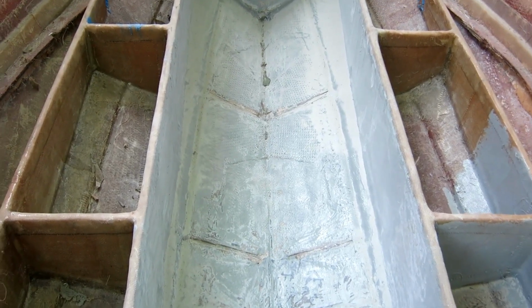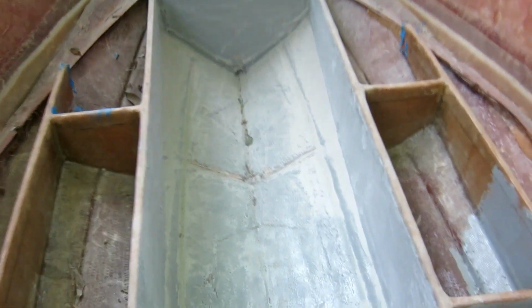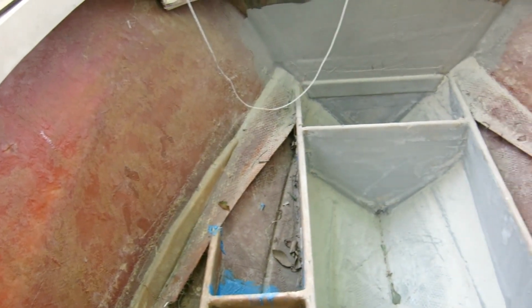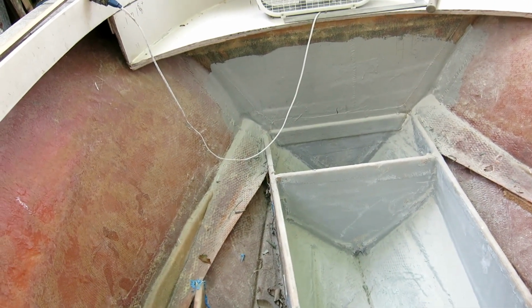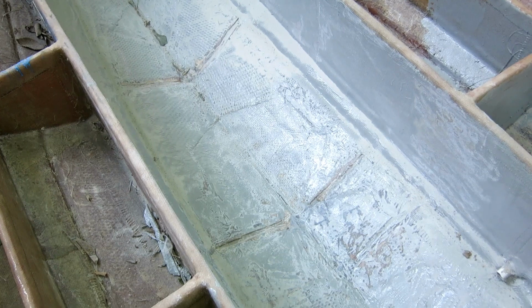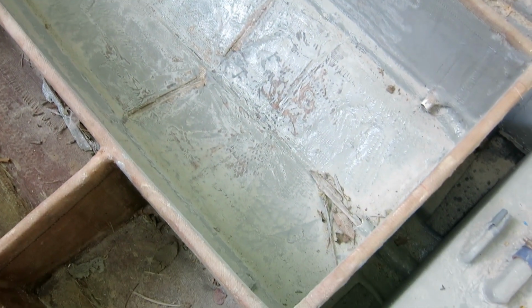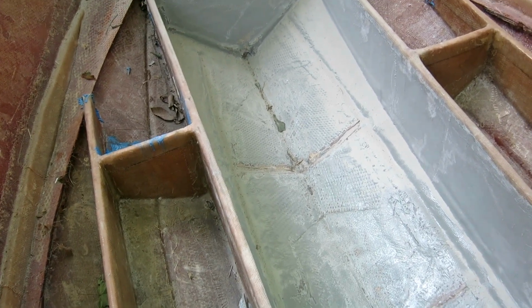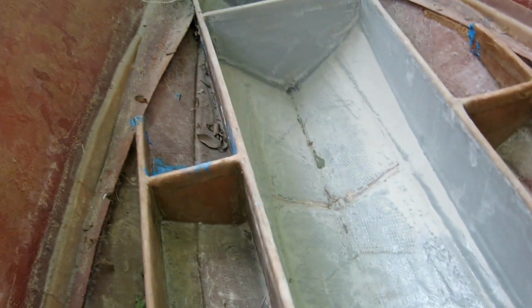Okay, finished off the day with some serious grinding. I can put this bulkhead in the morning. I can put the false bottom in the water tank in the morning, and I'm going to have to put a pipe underneath the storage box, so the front area will drain into this little mechanical area, but the ice box will have a separate drain with a plug because it needs to hold water. So plumbing coming up, lots of pipes.